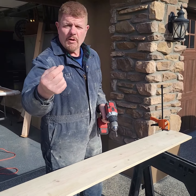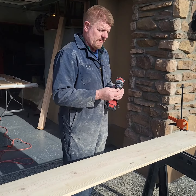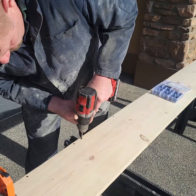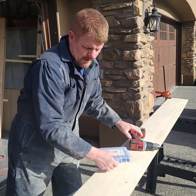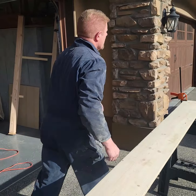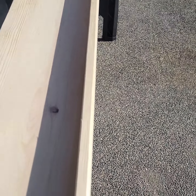I'm using a very small screw — these are self-tapping. That size is all it needs to go through and attach to the bottom. If we get too big of a screw we risk splitting that board. Now that we've got all the screws bracketed in, the byproduct has been that this has straightened out this board.